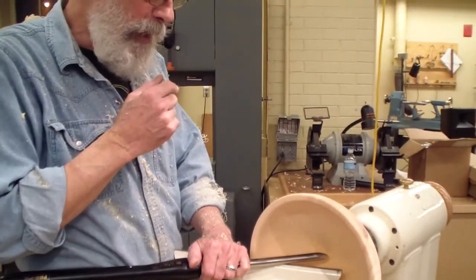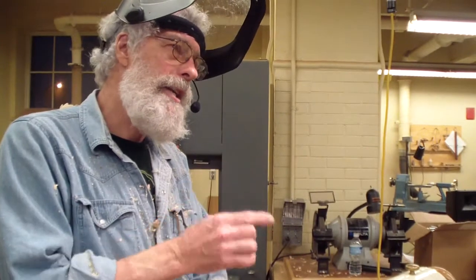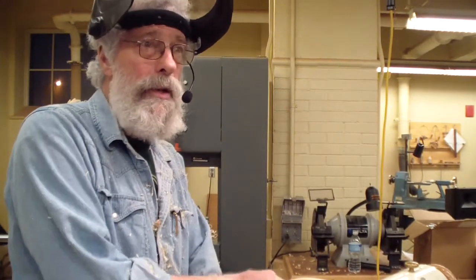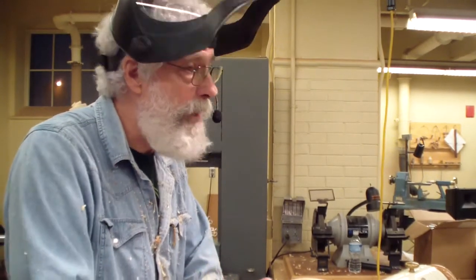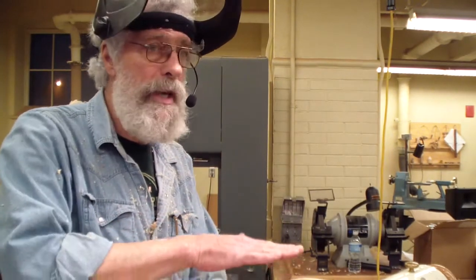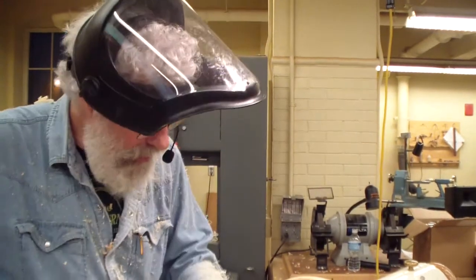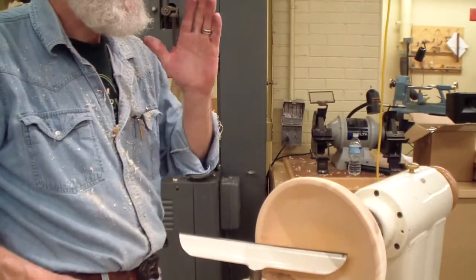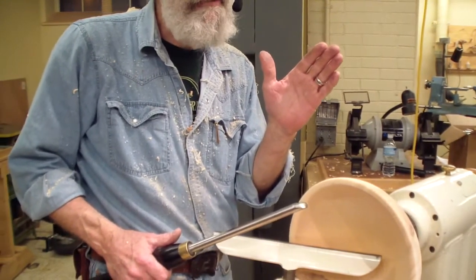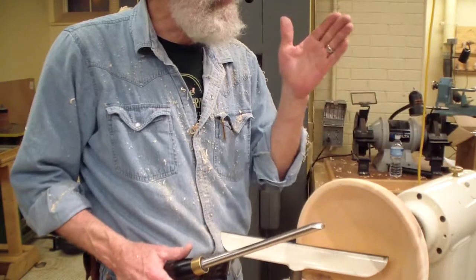So what I do instead is try to emphasize that the nib in the middle is simply one more spot on the entire curve of the bowl. So there's no reason to treat it any differently than any other location on the bowl itself. Meaning that you got down to the nib by staying on the bevel, so just stay on the bevel and cruise right through the nib and it'll be gone. It's very easy. Just slow the cut down, as long as your tool rest is at the right height, so that when the tool's level, you're right on it. Stay on the bevel, and keep the body moving microscopically to the left as you go forward with the tool, and that'll prevent you from cutting a flat surface.